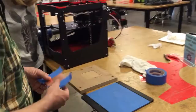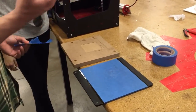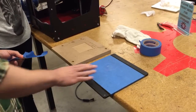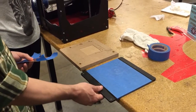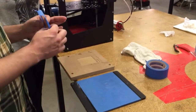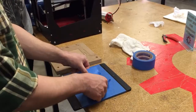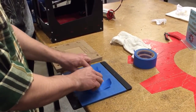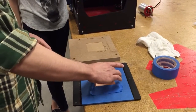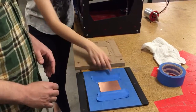Sure. We've been doing some circuit board milling so I'll give you a quick rundown. If you have a 3D print platform, you have this nice metal platform — when it's in the machine it's perfectly level, so it's a great place to start. All you do is set the circuit board down with two pieces of tape on either side, press down the tape, and it gives you a nice firm area to mill the circuit board on.